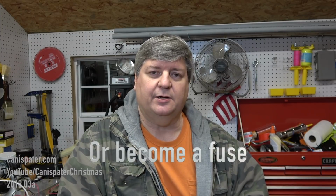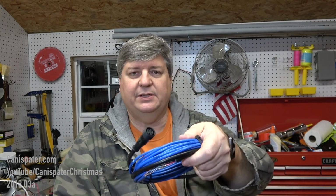The bonus footage that I'm adding is that I did a test to see if the cable would heat up when I'm running the pixels at 100%. This is a 27-foot cable. I just had some extra Ethernet cable lying around. I put pigtails on it so that it would work with the pixels. And I couldn't even get 100% white running through it. I think yesterday I was able to do that. So that was, first of all, kind of weird. But maybe because I coiled it up. I don't know. It was in a coil about this big when I was running my tests.